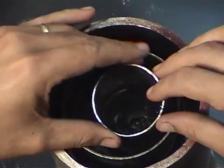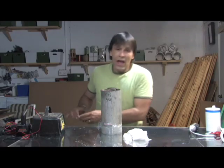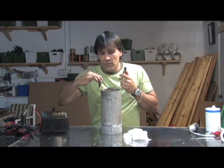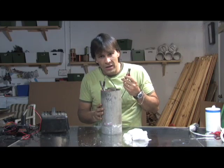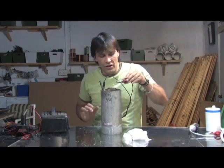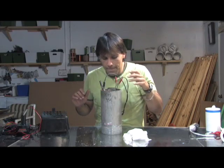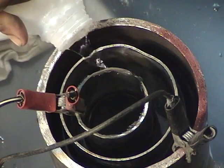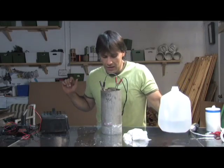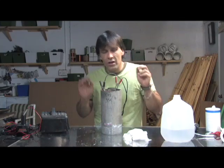They're all settled now. We have a 12-volt battery charger and we're doing this so we can see the amps we're actually pulling. We're going to attach the negative terminal to the outside — if this was your car, you'd always want the negative to be on the outside because your car battery is grounded to the chassis. Right now we're pulling zero amps. We're going to fill this a little bit higher with water, right to the edge, and we're starting to get some very fine bubbles.